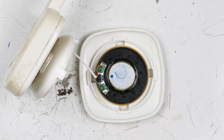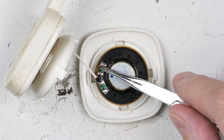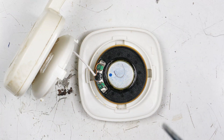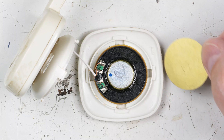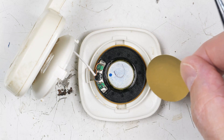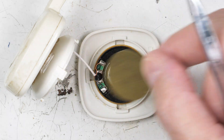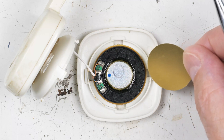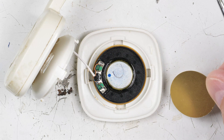I've got the other side open, and as you can see right in here, the wire comes in here. The plan is just to desolder it from the speaker, which is magnetic, and to substitute this piezo element — I think I'm going to try gluing it directly to this plastic piece and see how that works out. It's a little trickier because if I ever remove this, I'm going to have to be very careful to keep from breaking the wires when this plastic part pops off, but frankly, I don't ever plan on removing it.